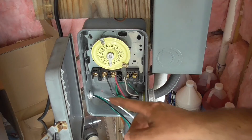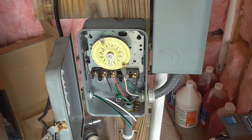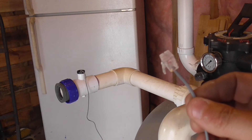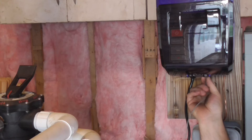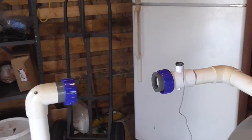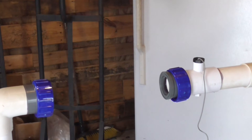On this timer it's number two and number four — should be the same as your pump because that's your load, and the pump is on 2 and 4. I'm going to connect all these wires and set that up. The flow switch has a wire that kind of looks like a telephone line and it connects up underneath the unit — I'm just going to snap that in. There's also a wire from the cell. I also found a little baggie with some silicone o-rings that go on these unions, so we need to put those on. I'll do a little zip tying, prime the pump, and I think we've got this hooked up.